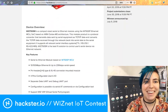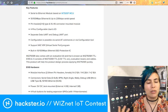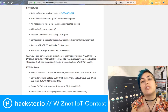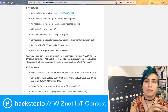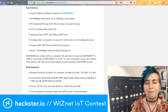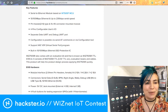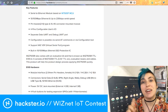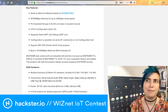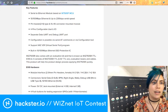Key features of this device: it's a serial-to-Ethernet module. Why would you want this? Well, if your hardware is talking serial and you want it to communicate over a long distance, once you convert it into TCP/IP you're no longer sending information bit by bit — you're converting it into packets which have headers. Ethernet then does validation, collision detection, and can even retransmit dropped packets. Packets can arrive in any order on the other end but they'll be put back together correctly, which helps a lot with sending over longer distances and avoiding noise problems.